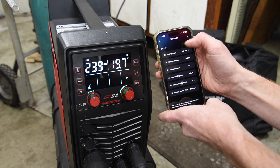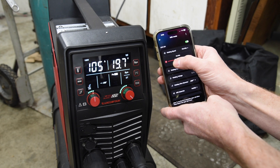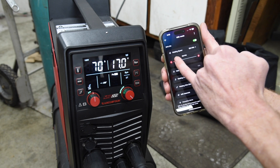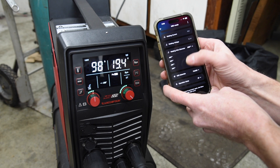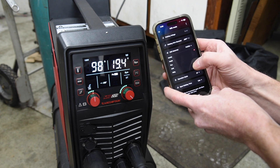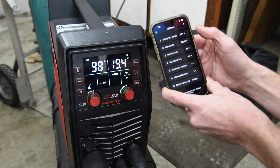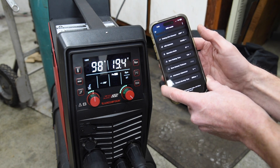So if you switch to Synergic mode on, I can adjust the welding speed here as well. It's really cool that even the LEDs on the dials self-adjust to match the setting I'm picking through the app. I can also adjust the welding wire diameter, choose my wire type, operation mode again, spot welding time — material thickness isn't adjustable in Synergic mode — inductance adjustment, and reverse burning time.